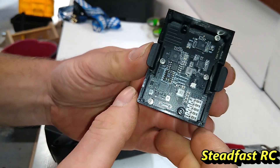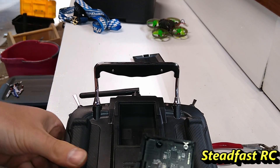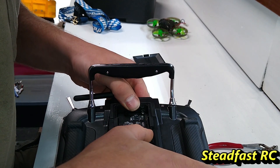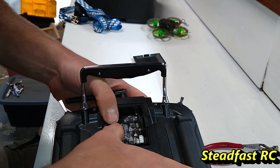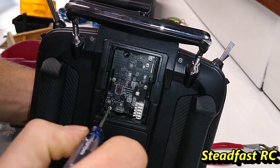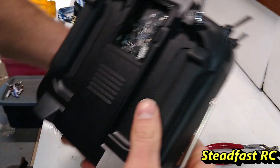Alright, I've got the four screws in. Make sure this is oriented correctly — it's really the only way you can put it in, otherwise some of the screw holes won't line up. I left them loose so I can still wiggle the module around. Now we're going to slide this into the back of the radio. I left the module loose so the pins coming out the back of the radio will center the module — if the screws were tight I could possibly bend a pin. So I'm going to make sure the module is going in properly, then click in the keepers on either side. Now I'll go ahead and snug up those screws — not very tight since they're small screws going into plastic, just nice and snug.